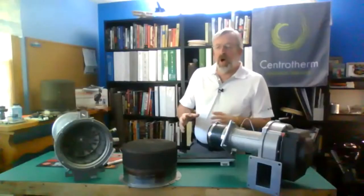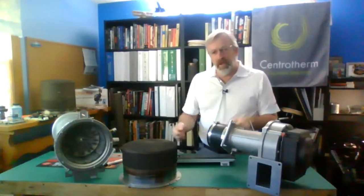I stop it right there because the video fires the boiler to check for leaks, but our preference is to use the fan — pull that pulse width modulation signal off the fan and let the fan run, then do your leak test. They also put the insulation on top of the heat exchanger first in the video; we want to check for leaks with that insulation off the heat exchanger so you get a better look at things.